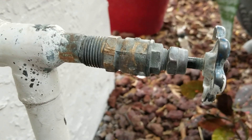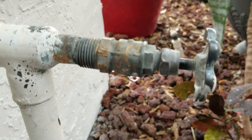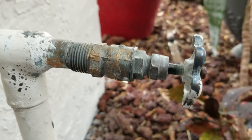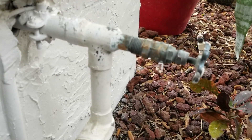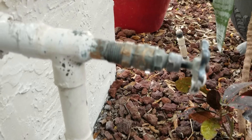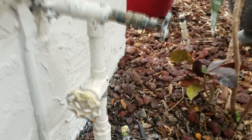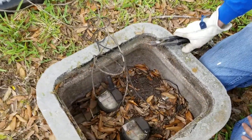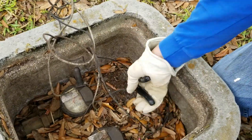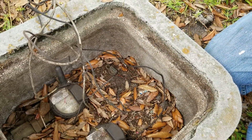You can see it's still dripping, and that's too much water flow inside the pipe — we know it will not be able to melt enough to separate that out. So we're going to try to shut it off at the street, because obviously this gate valve right here isn't doing its job. That's quite common, we see this all the time. In this neighborhood we did a house a couple of years ago where the gate valve would not close all the way, and so we swapped it out with a quarter-turn ball valve. Those wires you see lead to transmitter sensor things — that's how the city is able to wirelessly obtain your meter readings. So we're going to try to turn this off at the street — it's a quarter turn and that's all it should require.